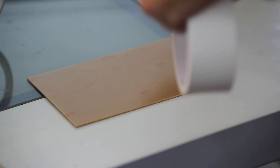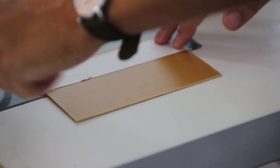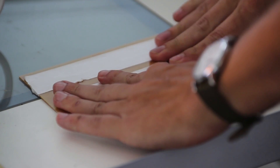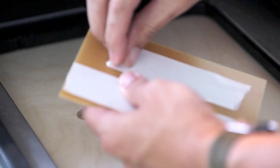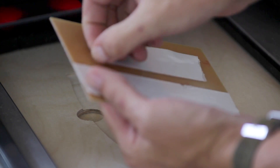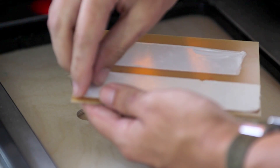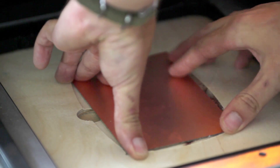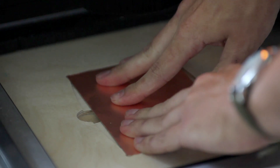That's part of why I added those arcs — so that even if the edge quality wasn't great on the jig I would still be able to get my circuit boards in and out without having to clean it up too much with sandpaper. The circuit boards fit pretty tightly in the jig but I like to have a little bit of extra reinforcement so they don't pull up when cutting in the middle. I just use carpet tape — double-sided, pretty sticky tape. I'll keep it covered until right before I use it because it will accumulate dust and not stick as well. You can see that the jig is pretty tight — I have to press pretty hard on it to get the corners to pop in and push down the middle to make sure it's seated well.